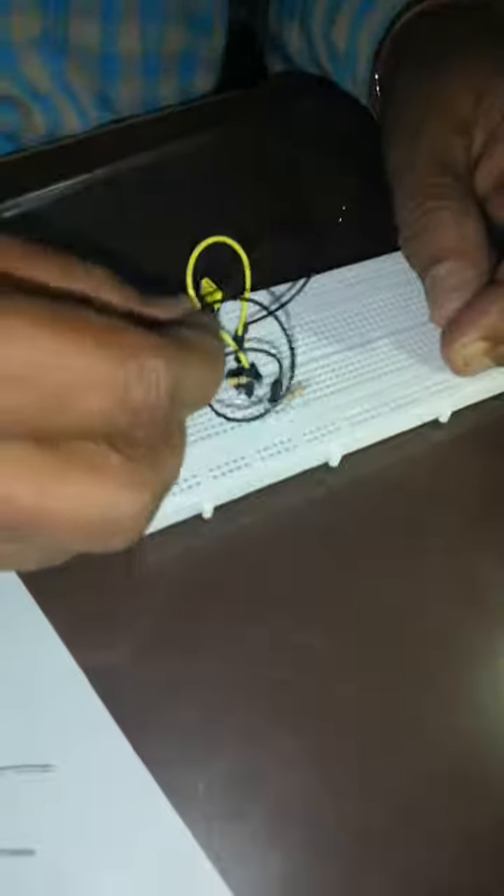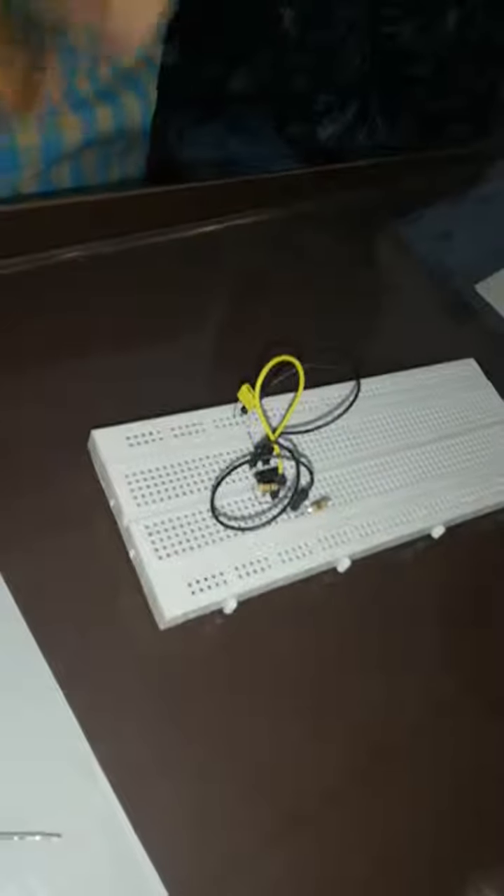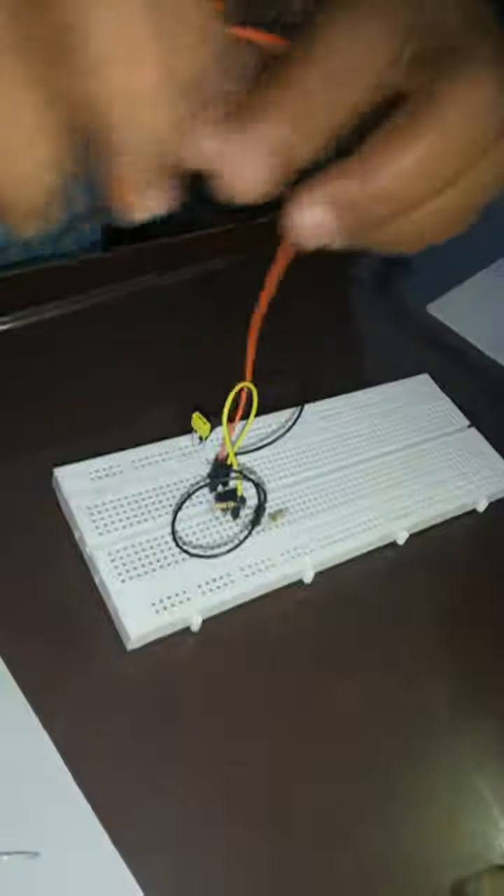Yes. Now 8-4 needs to be shorted. This is your pin number 8, this is pin number 4, okay, it's done. So this part is all completed now. Output order will be at pin number 3, so I have to put pin number 3 here — it will connect to pin number 3.